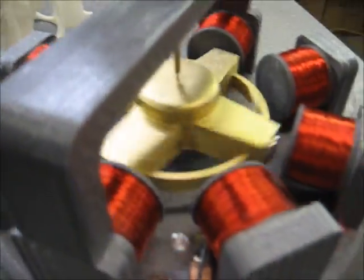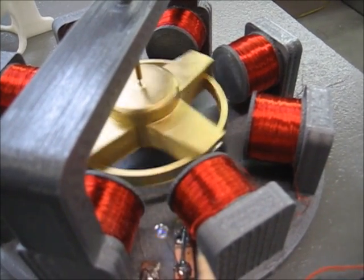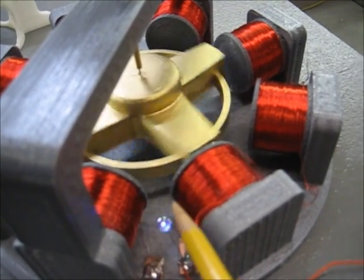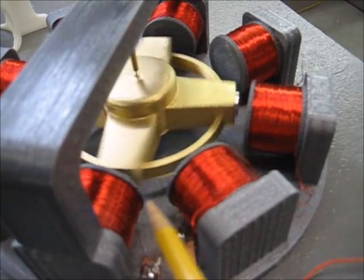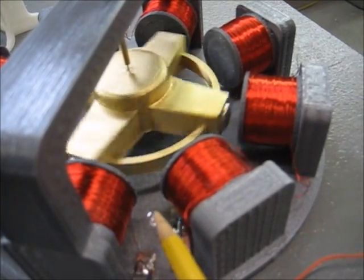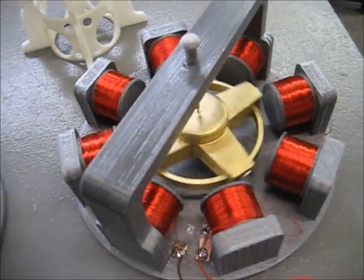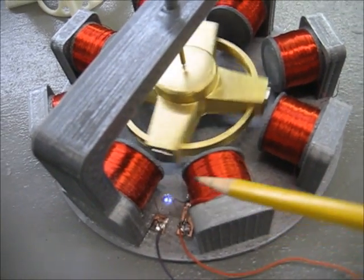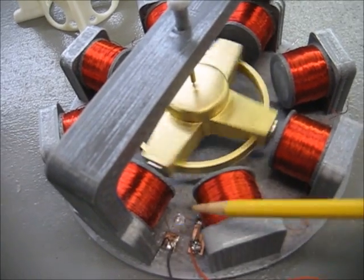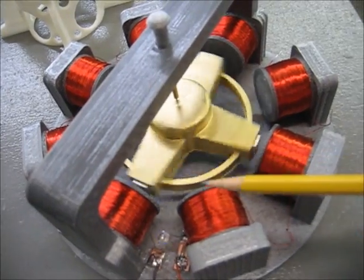Now, on this other 8 inch, we're looking at the coil being pulled in by this magnet, because it's just past the center of this one. So remember, it can only pull once it's past this reed, once the reed releases. Because if you turn the reeds on, if you short this out, the magnets will all go directly center of these coils, which means it can't move any further. That's the zero neutral point of the magnetic field that's generated across these poles.